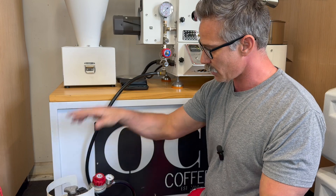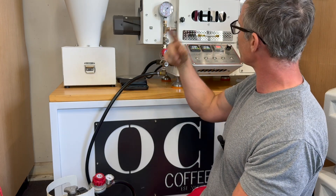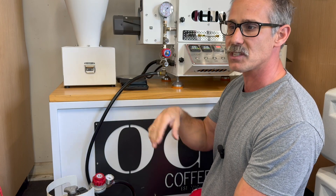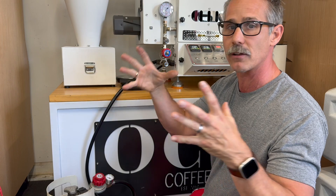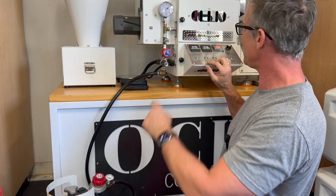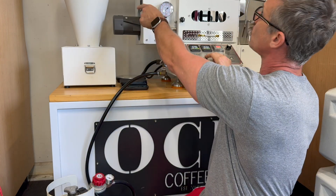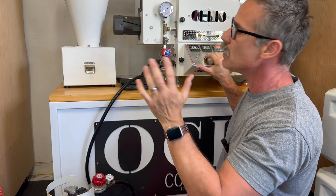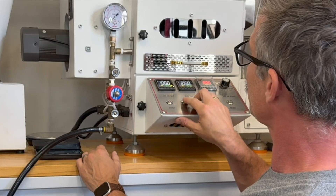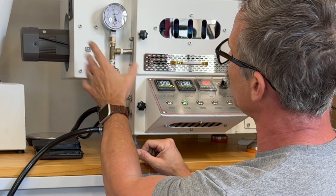I've got my gas on, my PSI pressure up, and I've opened these a quarter turn. I'm going to turn my roaster on. I've got air going and my drum spinning. Just make sure your air is on at least to about 20 or so, just so you have some flow through. I've made the mistake of turning my gas on without airflow, and you actually create a vacuum and could blow up your roaster. So I'm going to hit the heat — my heating button is my ignition button. I'm going to keep my eye on my KPA. And it went straight to six, so I'm going to shut this down a little bit. Now I'm at two and a half — I'm safe.